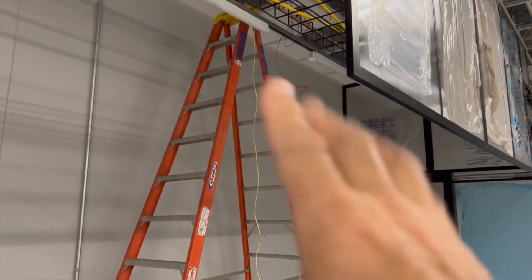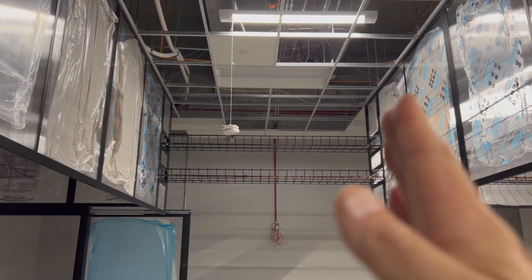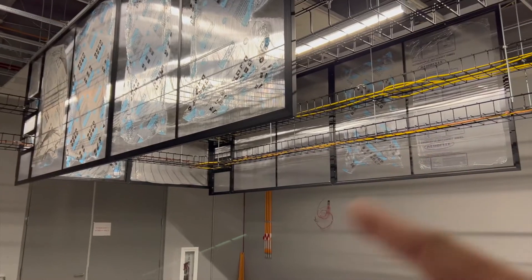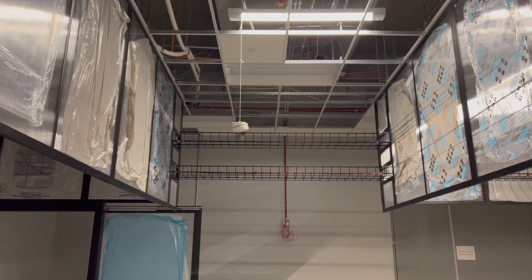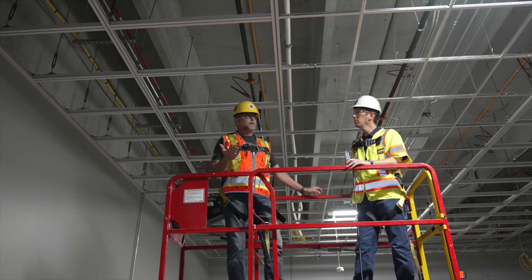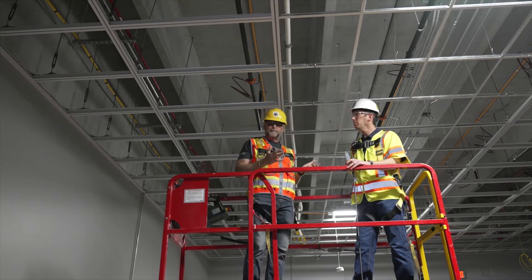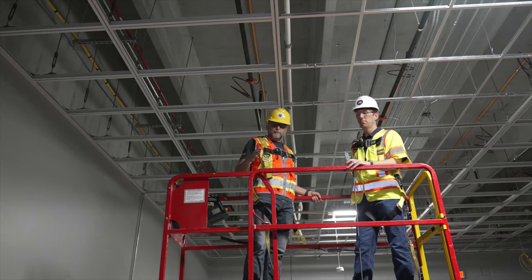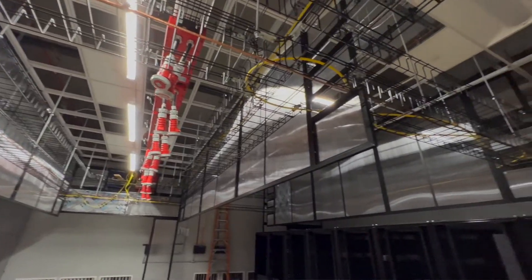Right here is one hot aisle containment area. As we move out of that, this is the Prelude — this is the 'strength where you need it' concept. The CLPs are just dropping rods intermittently. And then we go over to another hot aisle containment area where the racks are going to be as well. This is just open space — you don't necessarily need Dynamax or anything load-bearing here, so we're just going with standard Prelude grid. If you're not carrying load, don't put a structural grid system where you don't need it. I'd urge customers and distributors across the country: when you're looking at projects and things are over budget, or there's some value engineering that has to go on, value-engineer in a 'strength where you need it' type system like we have here.